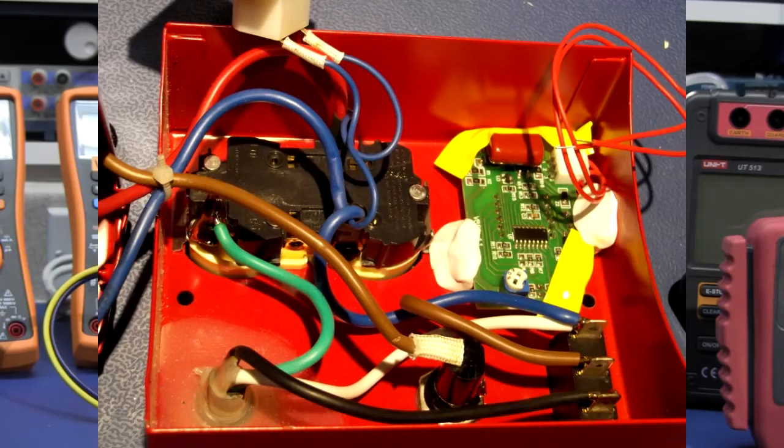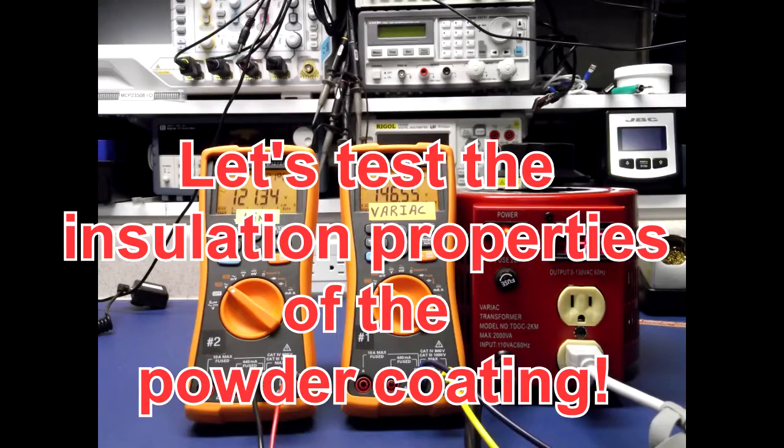You can see that the ground wire is connected through to the electrical outlet correctly. However, the ground screw or the center screw for mounting the outlet to the chassis is not making any electrical connection to the chassis. This chassis is powder coated. It isn't painted. It's a very tough powder coat. There's absolutely no electrical connection from that outlet ground screw out to the chassis.